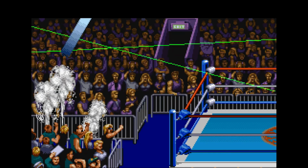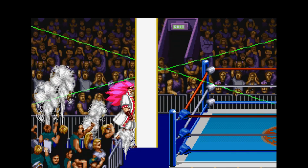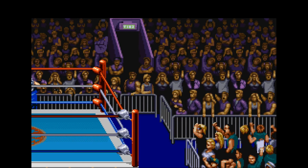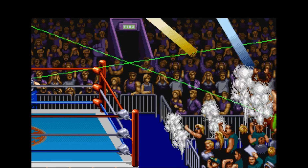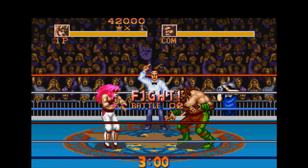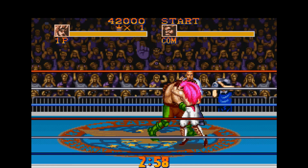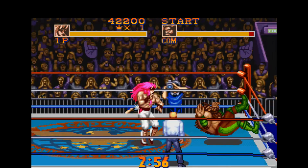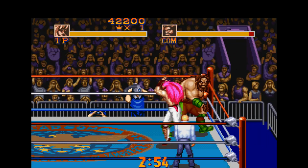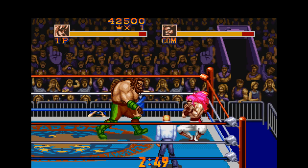Luckily, most TVs will upscale small images to larger sizes so that they fill more of the screen. This is done by multiplying the lines being output. Different TVs handle this with different levels of success, and sometimes the image will come out blurry. A way around this is to use an external device to handle the upscaling, which will handle it in a much more efficient way and give better picture results. It also means that you can connect into the TV using HDMI and an RGB signal, which is the highest quality you can get out of the SNES.